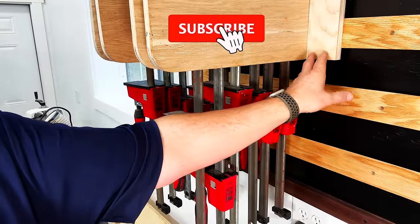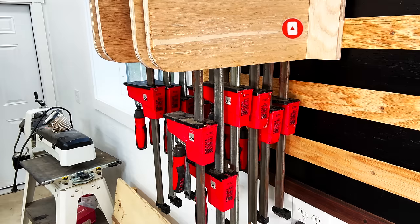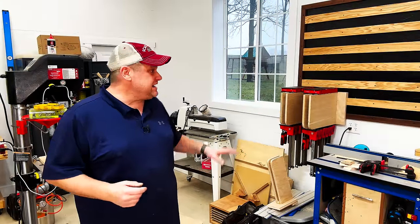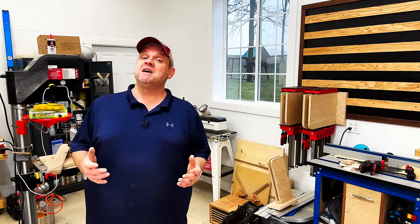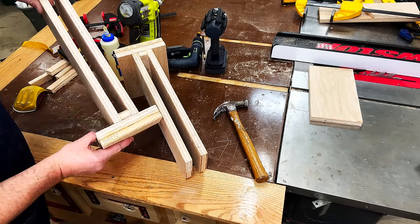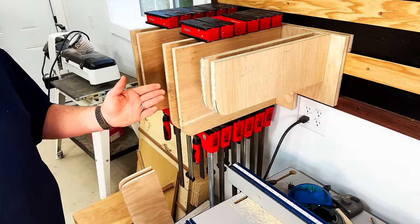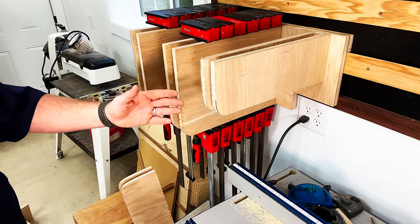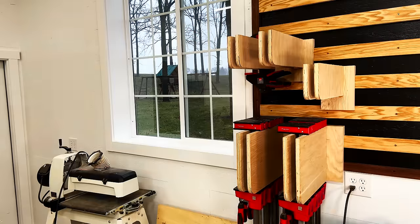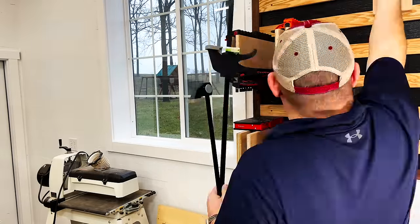I really like the fact that I can add a couple of clamps to each rack down the road. One thing to note: by hanging both racks so high I eliminate the usage of the cleats below, so I'm going to move both racks to a little lower cleat. This type of clamp rack isn't limited to heavy parallel clamps — you can also make these for your quick clamps. They have the exact same design, just a little bit narrower. Since the quick clamps aren't as heavy they only require a smaller support structure, but you'll still notice I have the support of at least two cleats on each rack.